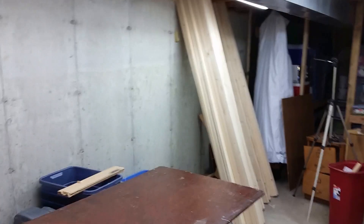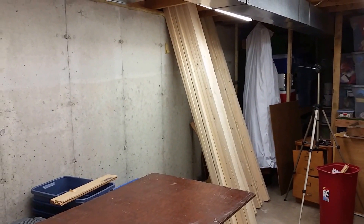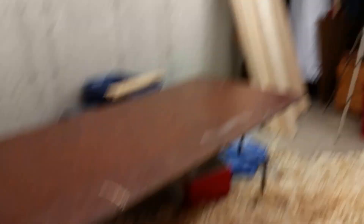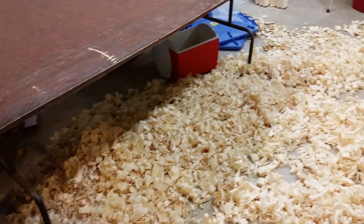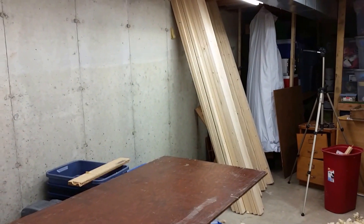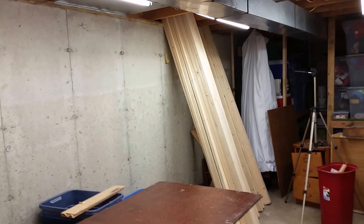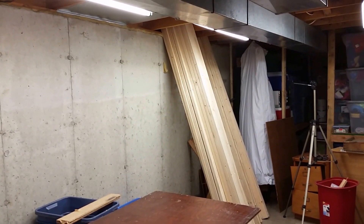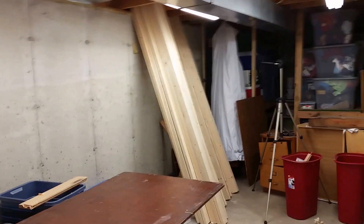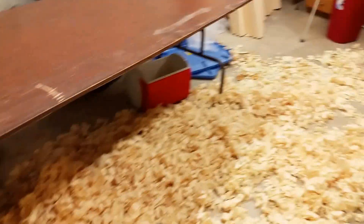Now I need to clean up, and the next thing is laying out boards for the top. I might get a glue-up tonight, but I'm probably going to wait until tomorrow afternoon. I'll need to do the whole top in three different glue-ups — I'll do eight, and then eight, and then put the two of them together to make one top. And then it's a lot more planing because I've got to make that smooth top and bottom. I hope you like the mess thus far — I've been having a lot of fun. See you next time.